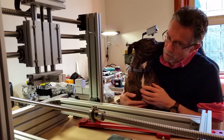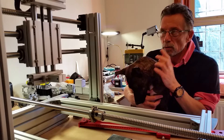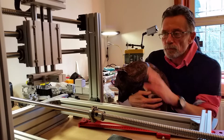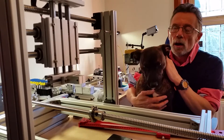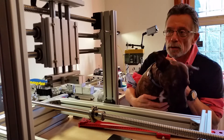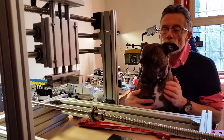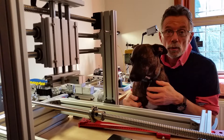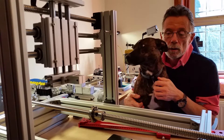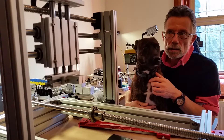A couple of things I learned: you have to have it pretty strong, because if you're going to cut anything other than cheese you really need something fairly rigid — and this thing is fairly rigid. Secondly, I learned that there's a different level of accuracy required for this sort of thing. Certainly for woodworking and many parts of metalworking it just basically has to be spot on, and that caused me to rethink my methodology.